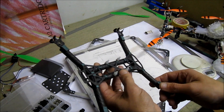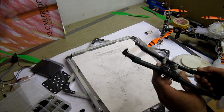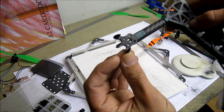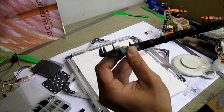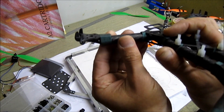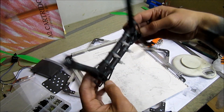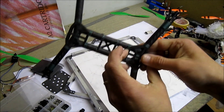Let's put it on the weighing scales and see — it's 50 grams, heavy bastard. Another thing I've started doing recently is trying to protect my motors, because the last few crashes didn't go well for the motors — they got stuck in rock gravel and destroyed the motor bell. So this time I'm trying to save the motors. The concept is to just bash it around, crash it, change the props, and go again. There's also zero flexibility in the frame.